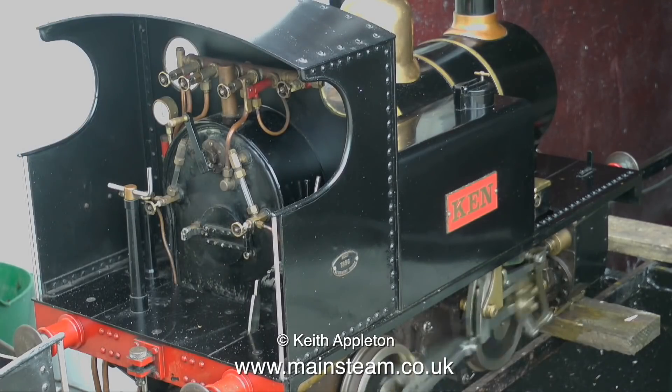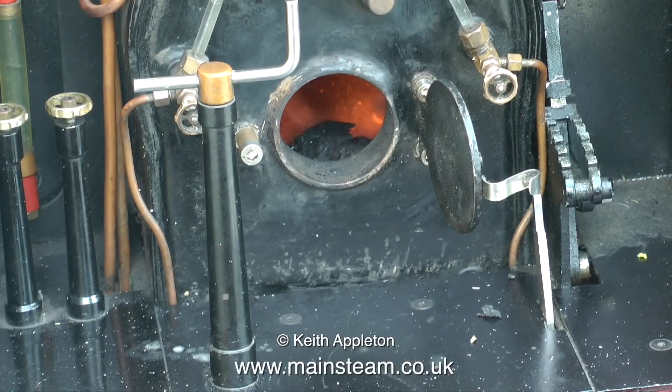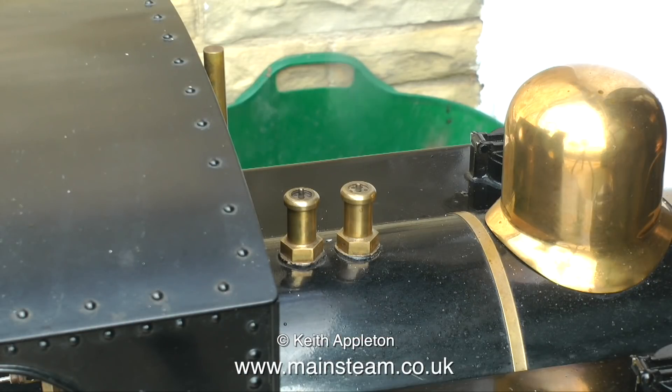It's much more difficult to build and set up a locomotive when the cylinders and valve gear are internal, between the frames. This is a very simple locomotive to build — it has Walschaerts valve gear, which is quite simple to construct, and building this type of valve gear teaches you something about how valve gear works. I did not build the boiler; I've never built a boiler because I'm not a boilersmith — it's an entirely different skill. This boiler was built by Randy Blackburn. After finishing the locomotive, I made a truck containing a brass water tank, because the water in the side tanks always got too hot for the injectors, but the water towed behind was always cold.